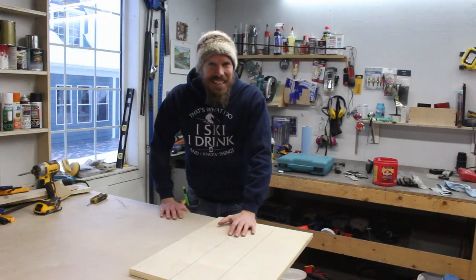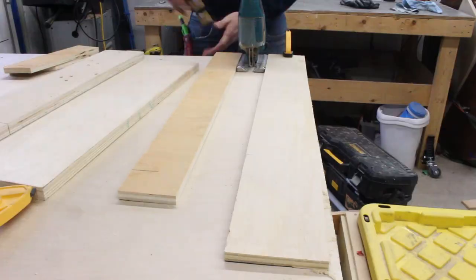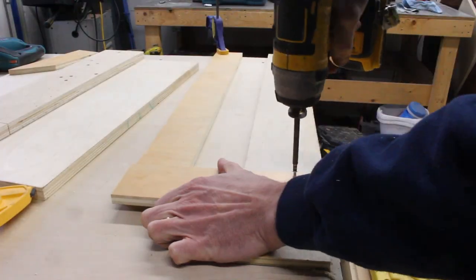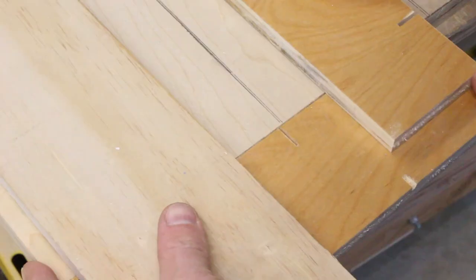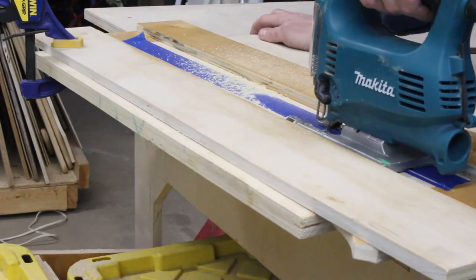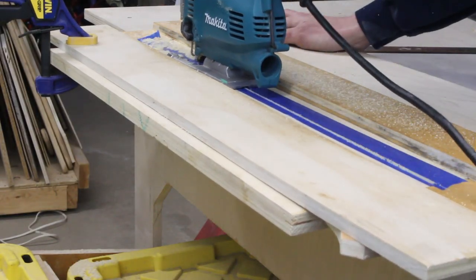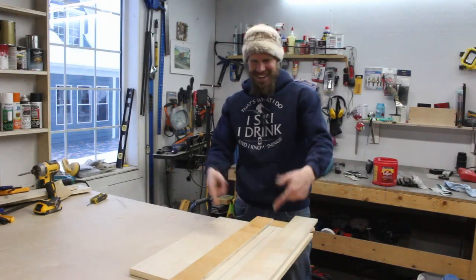Since you're going to be making tons of these to get some of that YOLO back, you're going to want to make one of these — this is an actual reusable jig. All I have to do is put this down, line it up with my cut, clamp it into place, and just start cutting. It saves a lot of time and you'll see a lot of people using this. Now when they say a jig, it's not what you're thinking about. That's a jig.